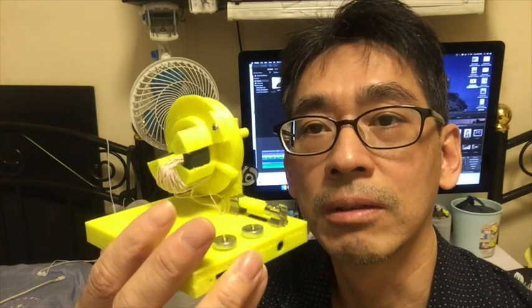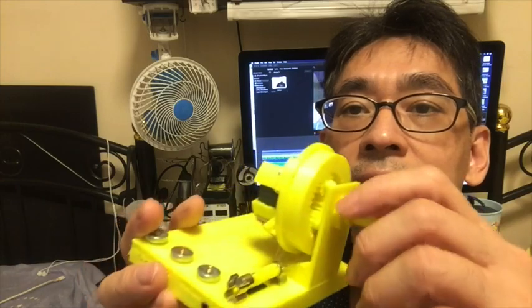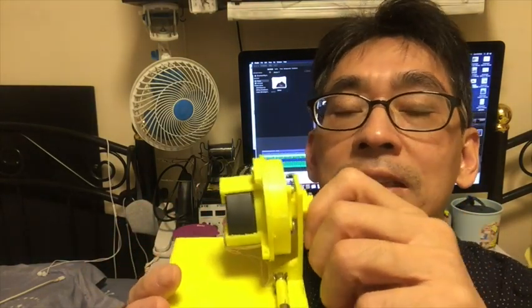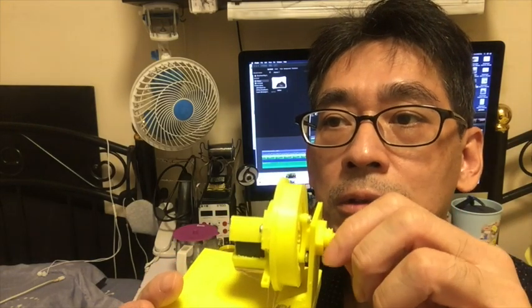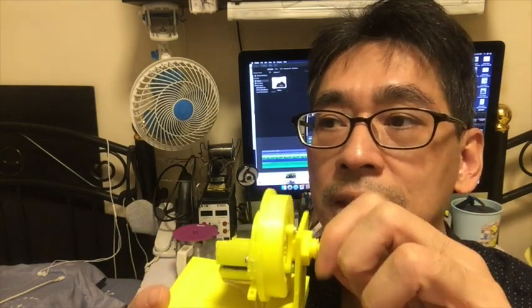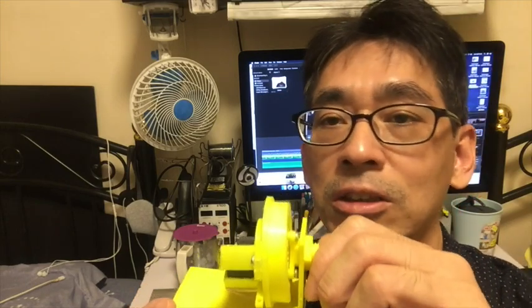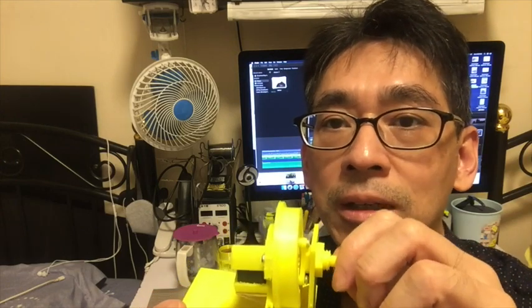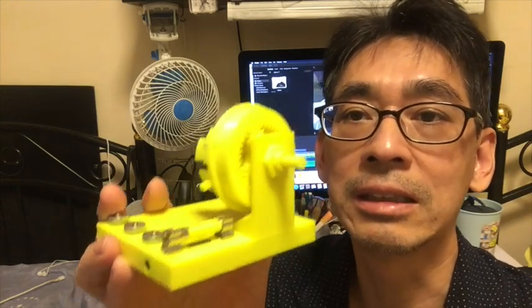The reason why we want to create the planetary gear is not just for fun. First, we need to achieve a 3-to-1 reducer. Secondly, we want to use the friction of the planetary gear to secure the ring ferrite in place. You see, the ring ferrite is cut in half. So because of gravity, if you let it loose, the half ring will always fall to the bottom and you can't keep the position with your variometer.